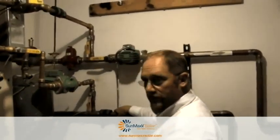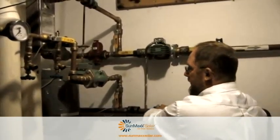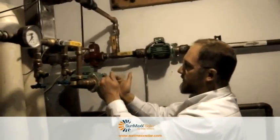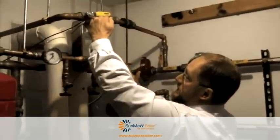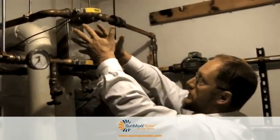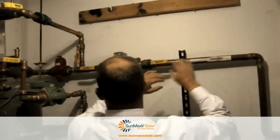We have a return from our floor — this is the fluid that's coming from our floor — and what we want to do is supplement. We're pulling heat out of the floor and passing it across the exchanger. We've set up a counter-current flow across the exchanger: our solar fluid is going down, our floor fluid is moving up. Ideally we're transferring the heat back into the floor and it gets delivered and dumped out into the floor that way.